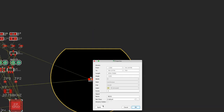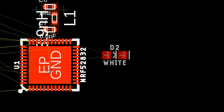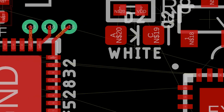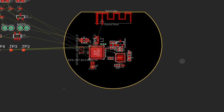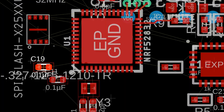Now I'm going to lay out a custom circuit board. The first thing I do is make sure the circuit board fits within the case. To do this, I export the circuit board from my CAD application and get started laying everything out. I'm going to go with 0402 components, and these are small enough to make the board compact, but still large enough that I can modify by hand if I need to.